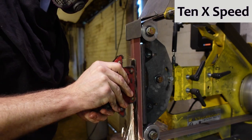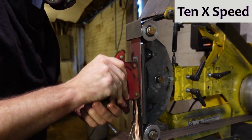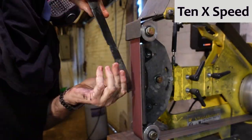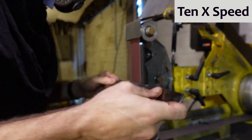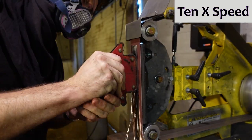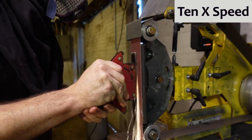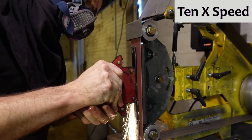It's the blade that's the real trouble. I'm pretty sure that if I had looked closer at this when I was making it, I would have noticed that the area where my blade and my grip meet, the Ricasso area, was the thinnest part. The whole thing was uniform thickness at one point, but that was the thinnest part. It was where my cut went a little wonky.